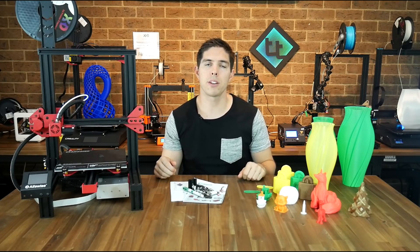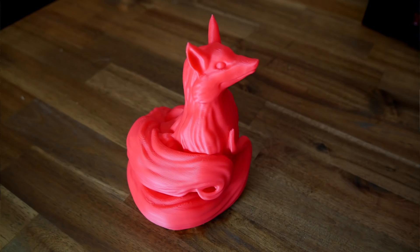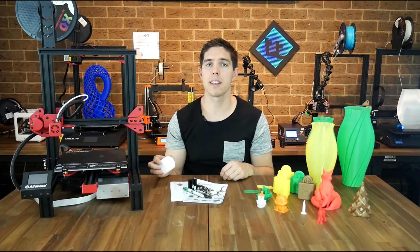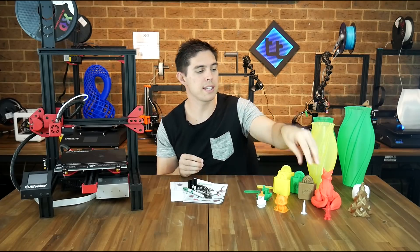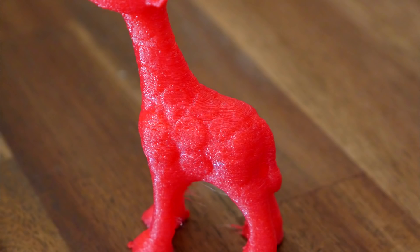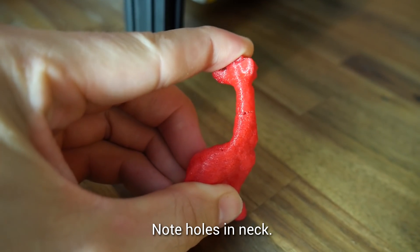I thought I should test some different materials, so I loaded up ABS and printed a box — probably the nicest print I got off this machine so far. The LCD lets you put the nozzle up to 250°C as a maximum, but it wasn't quite hot enough because layer adhesion is an issue, with small splits all around the model. Next up, a die test-printed in PETG — probably the second best print on this printer. The shape is formed well and there's no under-extrusion, although there's still inconsistent extrusion. My last test print was in TPU — a little giraffe. The extruder had no failures printing at 40mm/s, but the surface quality is not very nice, and there are some pockets of missed extrusion making it weaker than it should be.